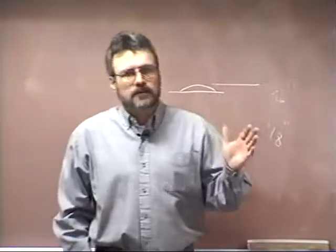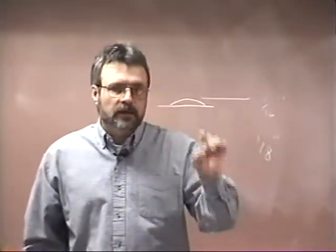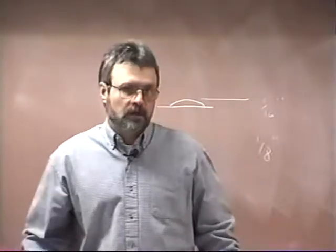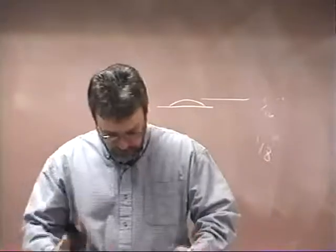And incidentally, when you get that keyhole, it's just like in any other of the joints that we've welded, whether it's plate or pipe. You got to listen for that sound of bacon and eggs frying in a frying pan. That's the sound of the arc penetrating that root opening. If you hear that, you know you're getting penetration. If you don't hear that, stop. Stop immediately. Make whatever adjustments you have to your amperage. Maybe the joint slammed up tight on you. Something's happened. If the joint slams up tight on you, you can take your grinding wheel and soften that joint and remove some of the excess metal so that you can go ahead and get through there.